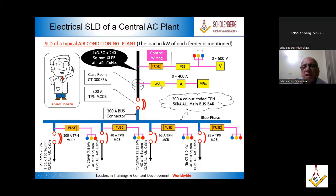Then we have this current transformer with ampere meter. Now this ampere meter is supposed to read up to 400 amperes, but you can't have a meter read up to 400 amperes — it will be huge and large. So we read it in small values. Accordingly, we have a current transformer with a ratio of 300 to 5. These 300 amperes will show as 5 amperes on this scale. So this ampere meter will carry only up to a maximum of 5 amperes rather than carrying up to 300 or 400 amperes.